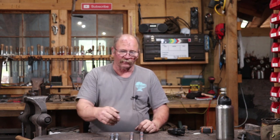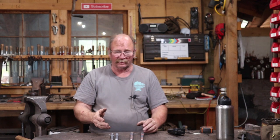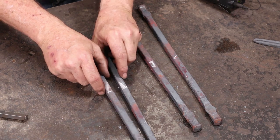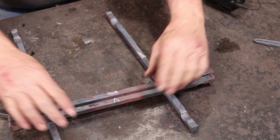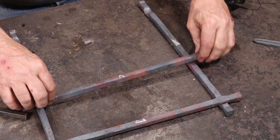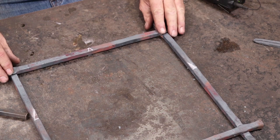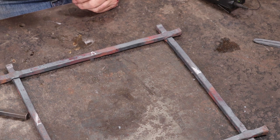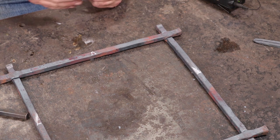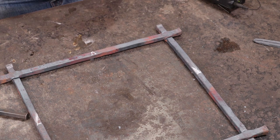To help keep things straight, I went ahead and marked these with soapstone using a cabinetmaker's triangle. By drawing triangles that always point up, you know that these two are the side pieces. And these two — the triangles don't match individually, but if you put them together the triangle always points up. That is the bottom, there's the top — and that way you can always keep it straight. For heavy forging this is going to rub off, and I don't really want to chisel it in. This is actually on the front — I'll just wipe it off after I drill the holes and rivet these together, which is the next step.